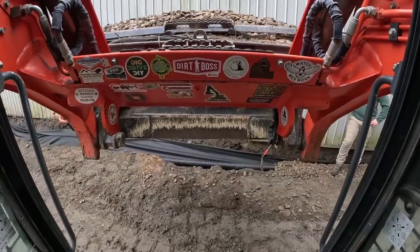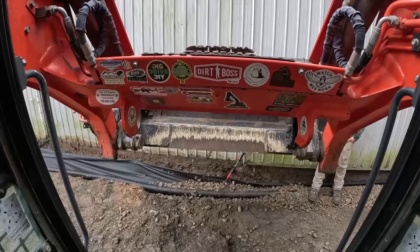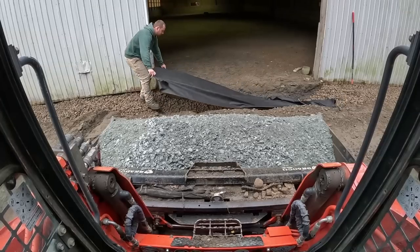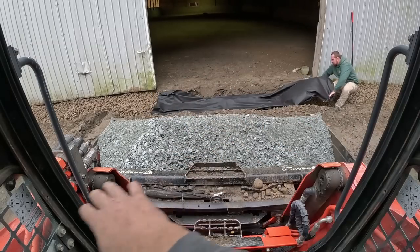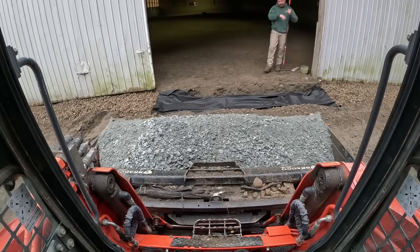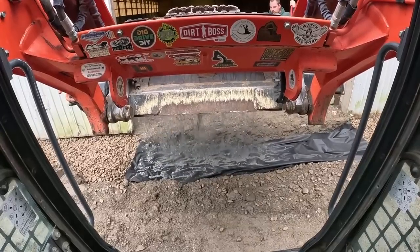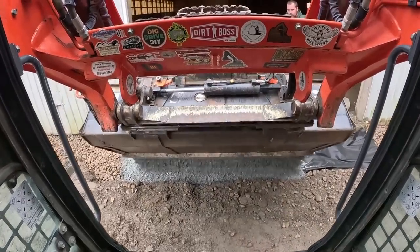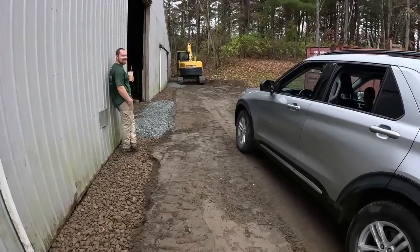You've got to hold the pipe as you dump - try to dump on both sides, otherwise the pipe will float up or push left or right. We're just pinning the pipe right now, then we'll come back and top it. We got fabric in underneath and stone over the pipe. In front of the doorway we're going to throw crusher run in - two foot off the barn with the French drain and stone - so horses and tractors don't have to worry about sinking. Horses do not like to walk on stone, so we're giving them the crusher treatment.